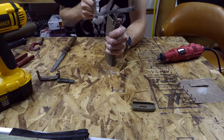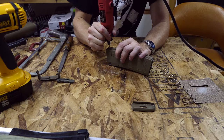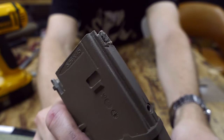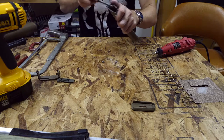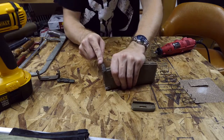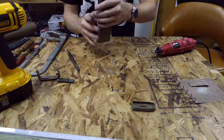Now that we've got the internal seated inside the external, we want to make that rear cut so that our last round bolt catch functionality will actually work. Use a hacksaw or Dremel tool as you did before to make tab cuts on the rear of the magazine - cut straight down from the inside portions, then use your Dremel to join those two cuts together and remove the entire little tab. Use the Dremel to clean up the edges a little bit, but again we're going to want to clean the edges completely with a file. Square off the corners and make it look nice and neat. Another thing I like to do is use a flat edge file to file the backside of the two remaining tabs to be flush with the main body of the magazine, so there's a solid amount of clearance for that bolt catch functionality lever on the internal portion of the mag to actually sit and engage.